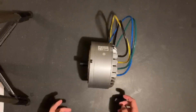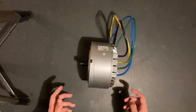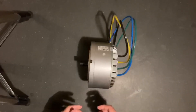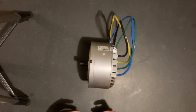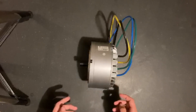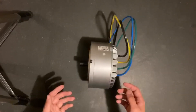This is where Wittenstein come in. Wittenstein develop customized products, systems and solutions for highly dynamic motion, maximum precise positioning and smart networking for drive technology. I have been in contact with Wittenstein and they have agreed to send me one of their SP Plus planetary gearboxes. The standard version of these low backlash planetary gearboxes with output shaft is ideally suited for high positioning accuracy and highly dynamic cycling operation. The SP Plus high speed is particularly well suited for applications with maximum speed during continuous operation.